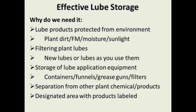to get lubricating oil for a centrifuge. He had another lubricating oil in there that was the same number, different product type, but it's for an ammonia compressor. And he put the ammonia compressor oil in the centrifuge, and that centrifuge didn't last 24 hours and caused a number of days of downtime for that unit because it took out all the gears in less than 24 hours. So we want to store our lubes in there and have them properly labeled.